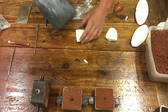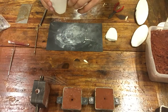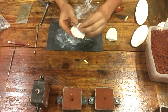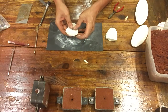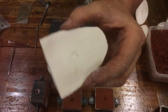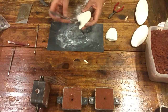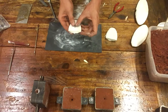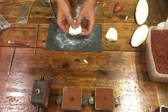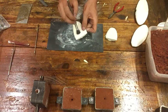At this point we have to decide where we want our sprue to go. We're going to have our button and sprue come in from the top again at that peak point of the star. I'm just going to gently press the star in, rocking it back and forth on all five axes of the star points. Once that's done you can see there's a little tiny star impression. Then I'll brush out the remaining dust, tap out the back, and place the star back in and continue to rock it back and forth to register in the cuttlefish. You can also carve the cuttlefish directly, but right now we're trying to get that impression copied. I'll switch to time-lapse because this will take a little bit of time.